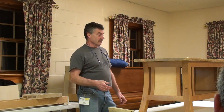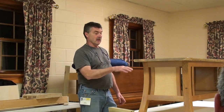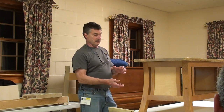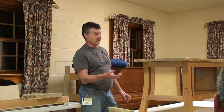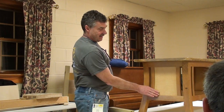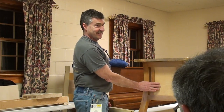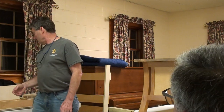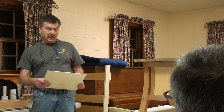I finished birch plywood and then veneered it in the vacuum bag with curly maple veneer — a layer or two on that substrate, top and bottom. I'm not sure if I'd use the same thing, but that was real straightforward. Where it got a little complicated is this plywood is on a radius, and I'd never done that before, so we got some bending plywood.